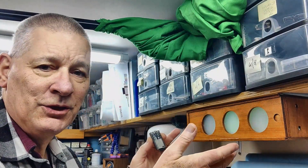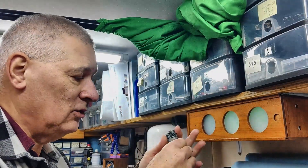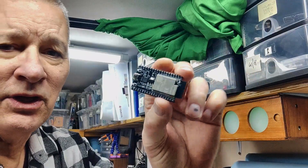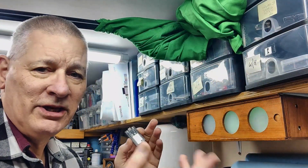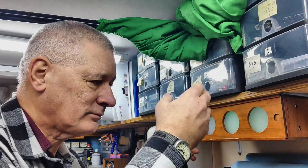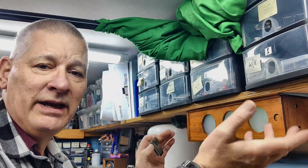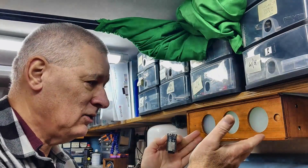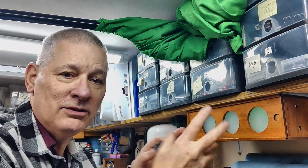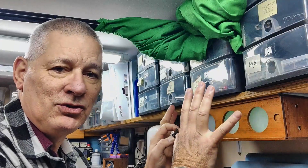The obvious thing to do was to turn them off at night when nobody's in here. I checked and yes, it was an ESP32 — so I thought job's done, it's a no-brainer. Simply get the time from the internet every 20 minutes or so, and if it's past eight o'clock at night turn them off, and if it's past seven in the morning turn them back on. It should have taken about 15 minutes of coding, snagging some old code I've used in multiple ESP32 projects.